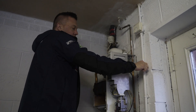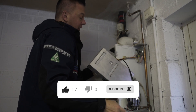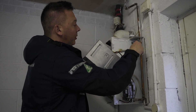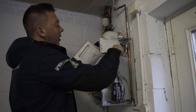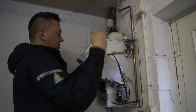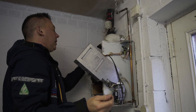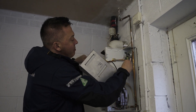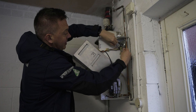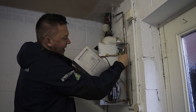I've brought a bridge from the van but it's easiest to do it from here. This is a safety device - it's called an air pressure switch which makes sure the fan's running so the boiler doesn't fire without it. To test it, we remove the sensor it's going through. What it does is go through that sensor - if it gets warm it breaks this link so it can't fire.